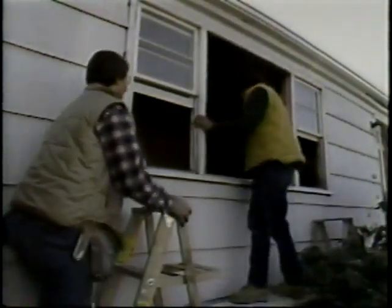Oh, Bob, I see the pneumatic jackhammer is finally doing the job on these front steps. Only way to go. $70 rental. Let me tell you about this big window here, Norman. We decided to save it because it's really tight and in good shape, or at least it was until I started taking it apart. And it had triple-track aluminum storm panels on it, so it makes a big difference.